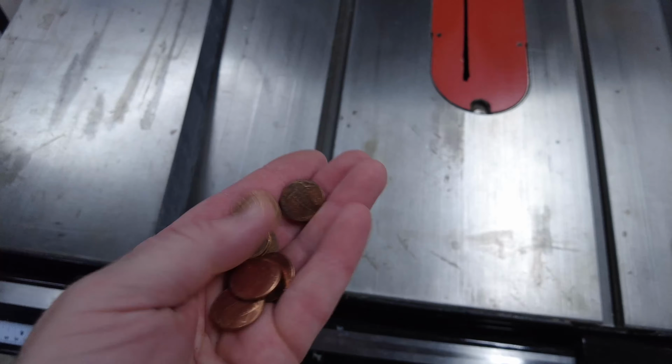So this crosscut sled is really just three pieces. You see that miter track piece, the big piece, and then this fence piece. And you want to make sure it's 90 degrees to that cut edge.